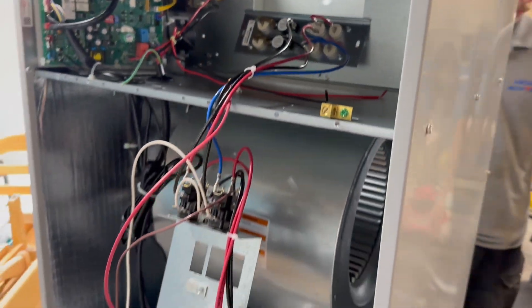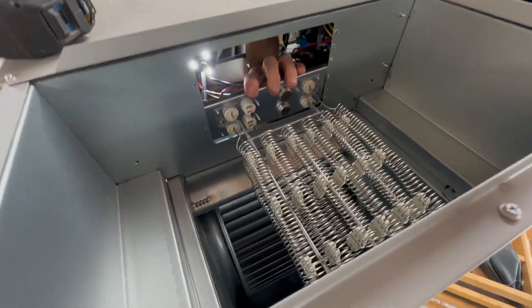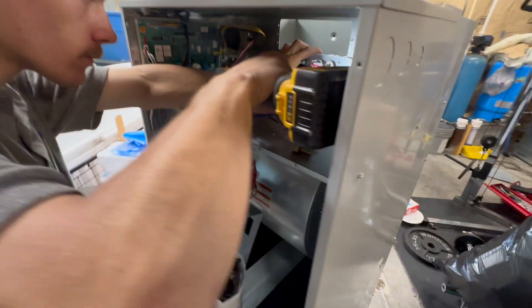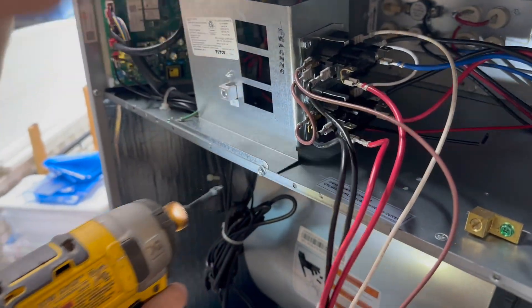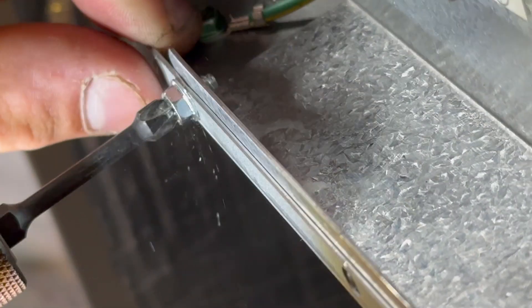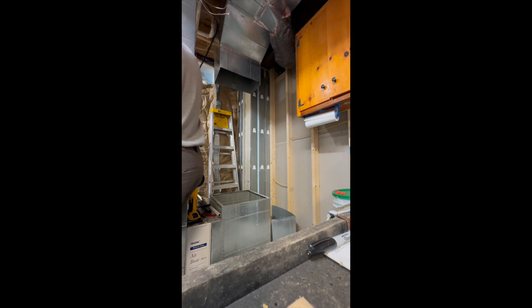Now Cadence is working on installing the electric strip heaters. The strip heater we're using is a standard style strip heater, not a modulating or three-stage strip heater. We are going to be wiring this as a single stage since we are relying on the Ultra to be very efficient and effective. This particular screw right here is critical — that is a rounded screw to prevent damage to the wiring that's going to be hidden underneath from these breakers. It's very critical to use that rounded screw that comes from factory.